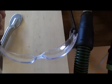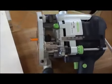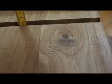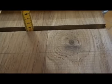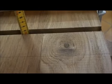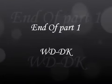Now it's secure. Remember to use safety goggles at all times when you work with this kind of machine. Now I have made the first run — nice and smooth with a straight edge. The depth is about almost 2cm. I'm going to go for 3cm; the first run I always go a bit deeper, about 2cm, and the last centimetre we will do with the second run. Please don't forget to use safety goggles.